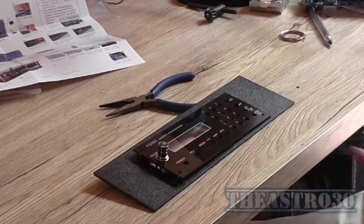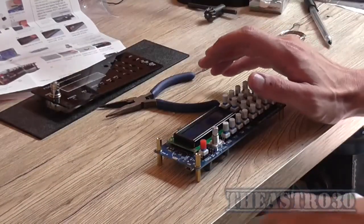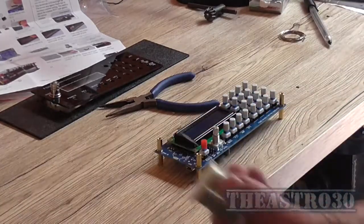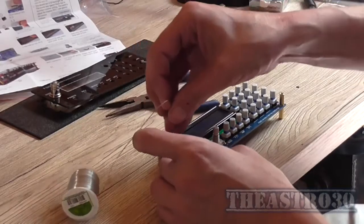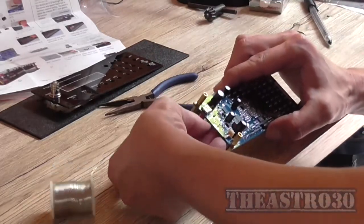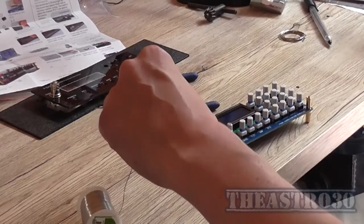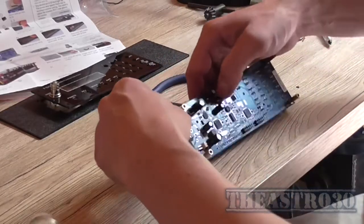But now that my screw holes line up, first I have to deal with that issue of the connections to the BNC socket. So a solution to that is this 0.8 of a millimeter link wire stuff, which I've had knocking about in place for a fairly few years. And I'm just going to put that through the board here in both relative places that it needs to go. So just keep that in mind, folks, that you're going to need some form of link wire to hook up the BNC socket later. So I'm going to leave myself plenty of wire. Do the same for the centre lead. And once it's in there, it's going to be fun to solder them, I can tell you.